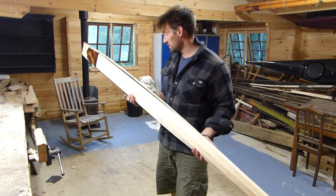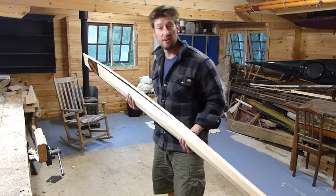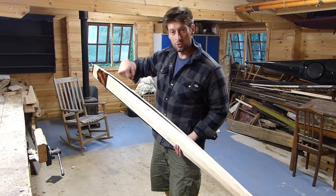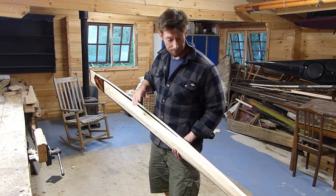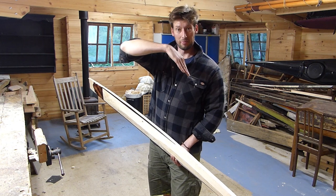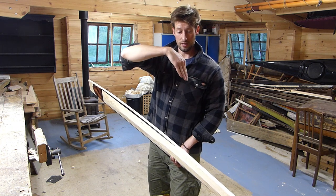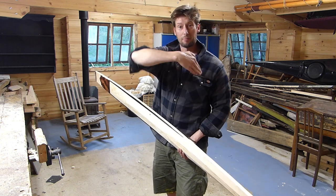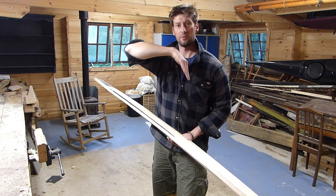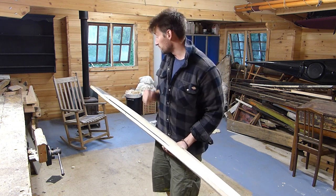Considerations I had when designing this sculling oar slash eulo: I needed it to be robust, I needed it to be very long, and I needed it to self-tail, or look after itself as you're paddling, so you're not relying on twisting and turning your wrist, and that's where the eulo element comes into it. Eulos are designed by nature of the bend between the shaft and the blade to scull naturally as you drag the blade across. The pivot point, the trailing end of the blade, will lag behind the angled part up here, or my wrist, and it will naturally do that, which sets the blade angle to the correct pitch for your sculling motion.